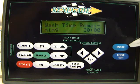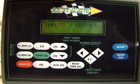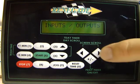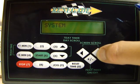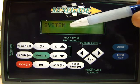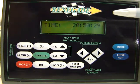What you'll want to do is push this mode button right here and hold it. Keep holding it until this input-output screen comes up. You can scroll to the right or to the left. To the right, it'll take you through several different screens: the memory bits, the timers, the system, the inputs, outputs where we started. What I do is I just go backwards to the left to system, press enter one time, it'll take you to time and date. Press enter one time again, and here's your time.